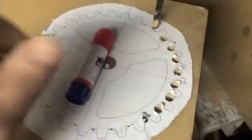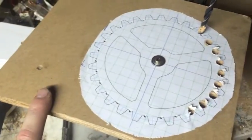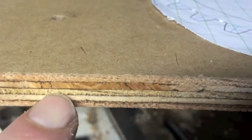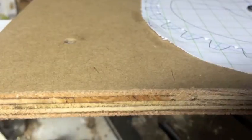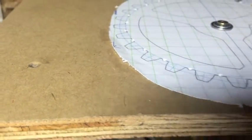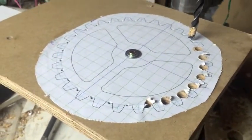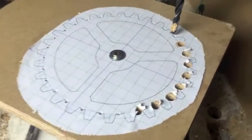I got a glue stick, go to the other side, and paste this down on my test piece of wood. This is called MDO — medium density overlay — it's what they make signs out of. It's a plywood core with traditional veneers and exterior glue, with a paper surface on top that you'd paint a sign on. It's quite stable and inexpensive — a half-inch piece is around 30 bucks for a sheet. I used it on another project, the truck cap, which I'll show in another video.